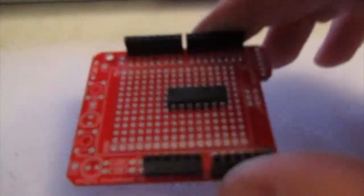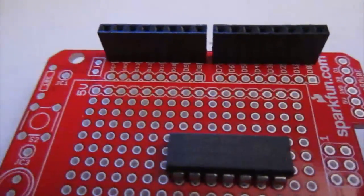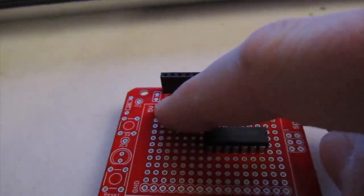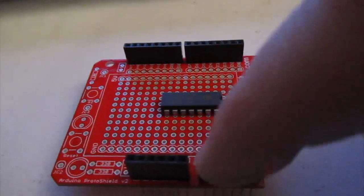It's not a Max 232 — it's one that I kind of had lying around. I'm just more comfortable with the Max 232 chips. My plan is to replace those jumper wires there with wires underneath on the underside, so it looks really nice and sharp. I'd like to have the converter chip and maybe a couple of headers up here that the analog pins connect to, so when that's connected to the pots, the connection is something I can plug in and disconnect.